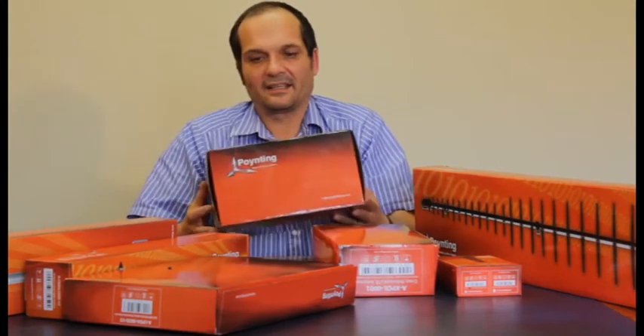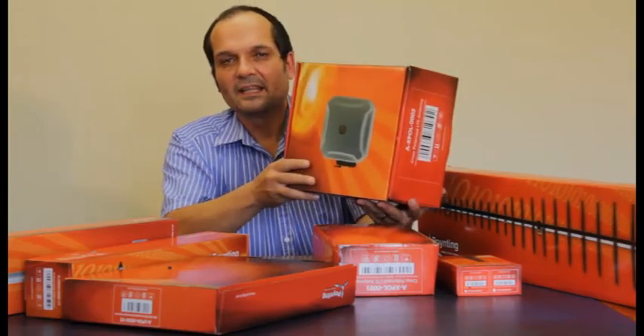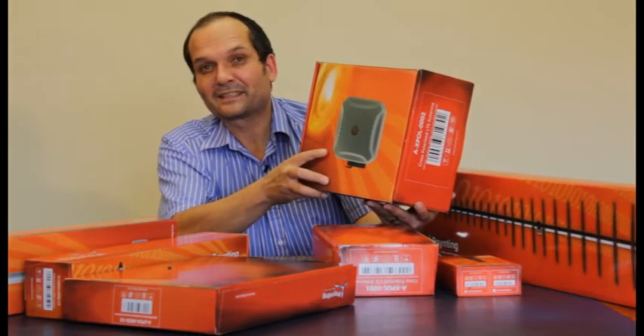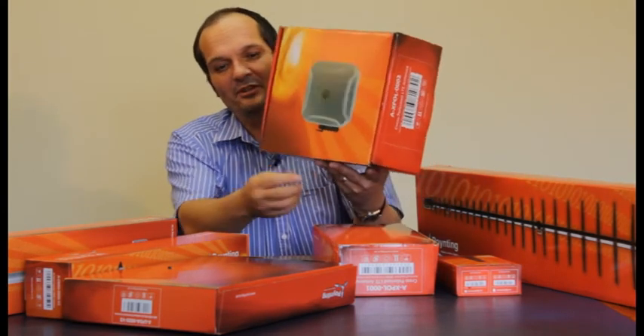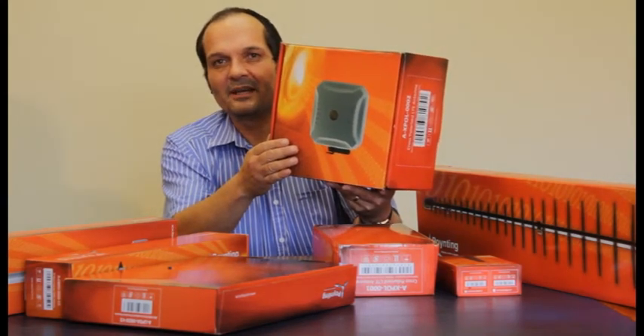A fantastic breakthrough in technology is the X-Pole 2. It's an actual patch antenna with about 8 dBi gain — 8 dBi and a bit higher. It covers everything from 700 MHz to 2.7 GHz, and there are actually two antennas inside — not discrete antennas, but two polarizations with two cables coming out. This will give you high gain across all the frequency bands you'll encounter in LTE use.